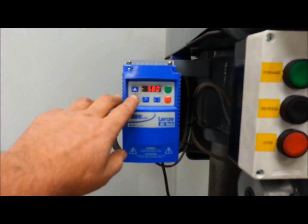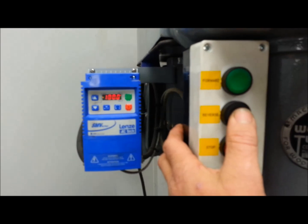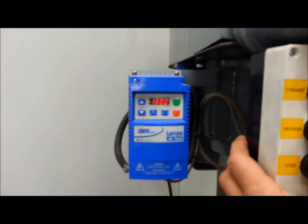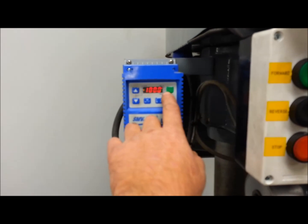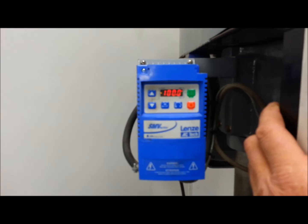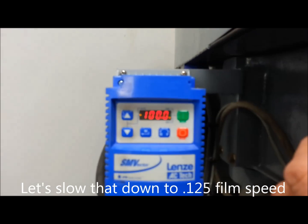Here's another example. We ramped up to a start and now I'm going to run it all the way to 100 Hertz — there she is running at 100 Hertz. I'm going to hit the reverse button. Typically this is a big no-no on a three-phase machine without a VFD, but you'll see the display go to DEC, which means decelerate. Within the unit it's using the DC bus to brake the motor — actually applying an electrical brake. You'll see a reverse command get applied and it'll blink until the reverse command is taken. It happens in the blink of an eye, but it decelerated the motor and applied the reverse command only after the motor had come to a complete stop and braking was finished.